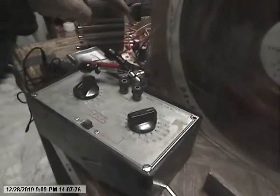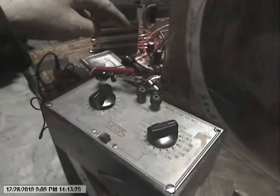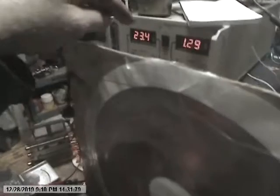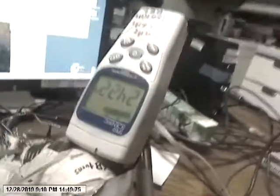This is a 1 MHz signal coming off of these, going into that. Digital meters don't work unless you've got one that can handle 1 MHz — I don't. So I use an analog meter. It gives me my best idea of how much is going in there. I'm trying to keep the input down so I can shove more of that into it. There's a bulb — that's that 14 watt, 120 ohm load. If I put a really big bulb on here this thing will peak — it's almost peak now from where I've seen it.